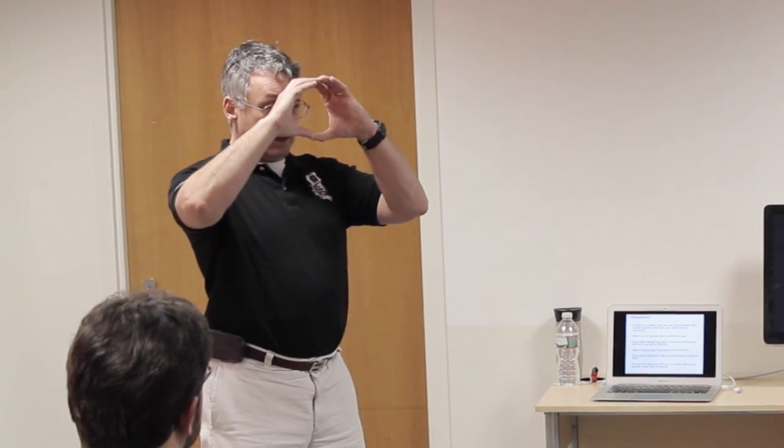I worked a long time ago for a company building ultrasonic inspection robots, which inspected the inside of steam turbine bores. A big steam turbine rotor weighs 75 tons, the shaft is this big in diameter, and there's a hole right through the middle, because when they forge it, bad inclusions migrate to the center, so they just bore it out. This thing rotates at 3,600 RPM, weighs 75 tons, and is 15 feet in diameter with the blades. If it comes apart, it's like a small nuclear weapon.